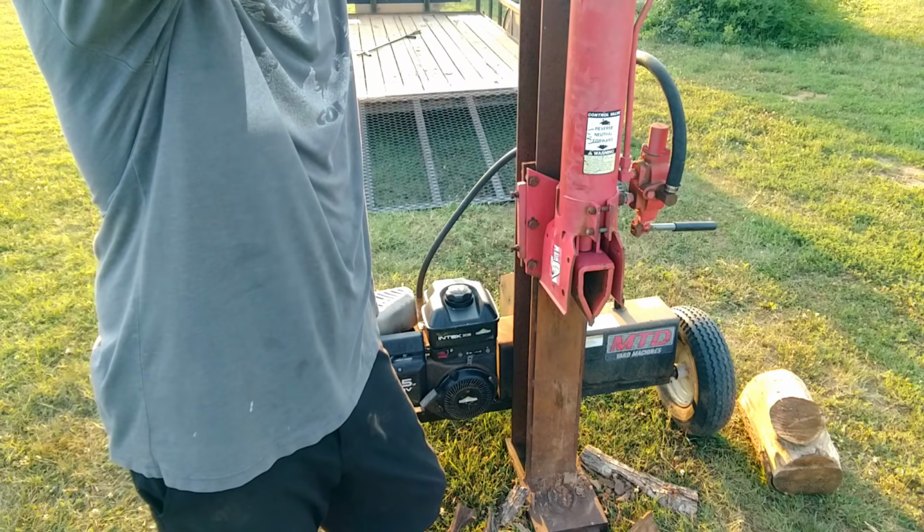But first thing I want to do, I just want to fire this thing up, kind of show you the speed it runs at with the gas motor. It's just not super fast, but it's already a whole lot faster than pumping one by hand, and it'll definitely speed up production, because one of those presses right there is 22 ton each time it presses. So up, down, up, down. If I'm doing hammer or something big steel, it stays hot for a good amount of time. So that's actually moving plenty quick enough for me to do hammers in. So that's what is so awesome about a press.